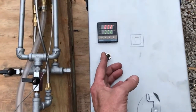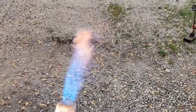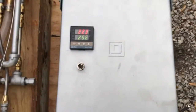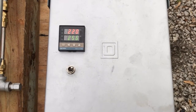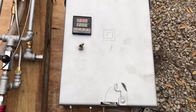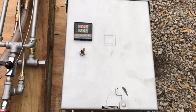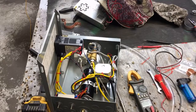We're going to turn the system on and run it until the red numbers stabilize and stop moving. Then we set the green numbers to a temperature that's about five to ten degrees below that, so that when a temperature drop occurs it will indicate a flame-out and the system will shut off.